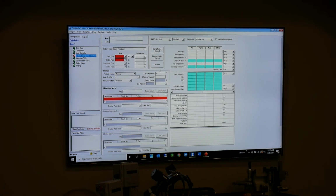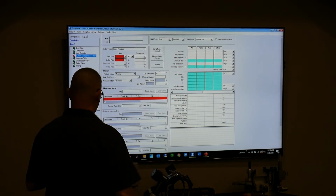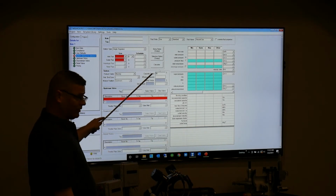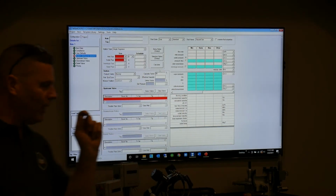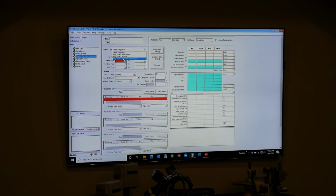And now we have to make new decisions. We have to give some input about the pipe size, the schedule. If you don't know the schedule, just put standard. Also, whether we're specing for a single regulator here, we're sizing for that. And also notice, it's already taken the 20% away we discussed. Unless we tell it to and artificially do it, it's not going to size for the maximum capacity, where we know that the maximum in every minute is at least that or less. So it's going to take that 20%. But I can go in here and do a reg and relief. I can do a regulator monitor. I can do a reg monitor and a relief.